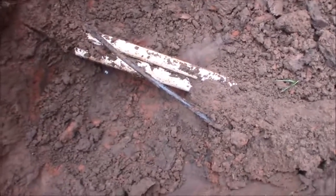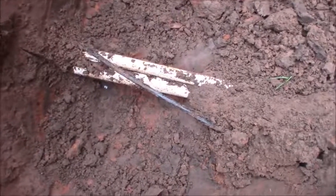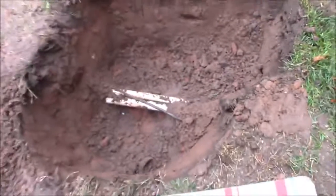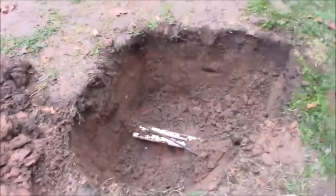The hard part here really is locating and digging. Since I already knew where the line was, the locating part was quite easy. That can be a real challenge if you know you've got a leak but don't know exactly where the line is. Digging here in this soil, with it being so moist, was fairly easy — not too big of a pile.